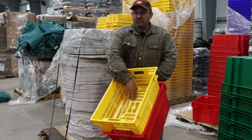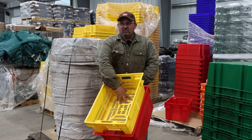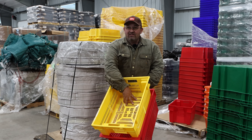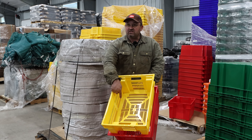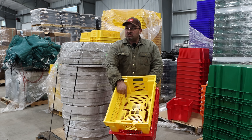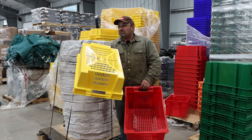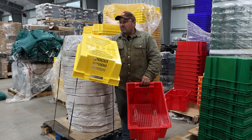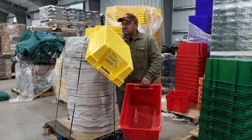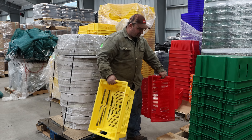You feel the inside of these — all the edges in the mold are chamfered, because these are molded, not shaped and then drilled after. So when you're looking at the longevity of your product, plus the more holes in here, if you're using the high-pressure rinse conveyor to sanitize your stuff, you put these in upside down because there's more pressure washer nozzles on the bottom than the top, and it's easier to wash the dirt and material out of the container. So that's some of the design features.